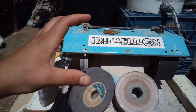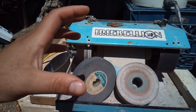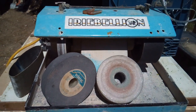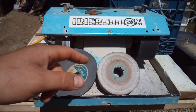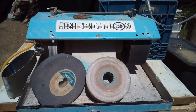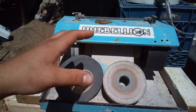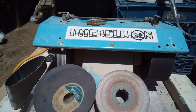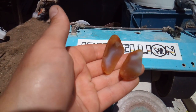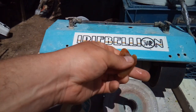When it comes to larger agates, I don't know anybody that polishes large agates on diamond wheels. Companies like Highland Park and Richardson Ranch make machines like the Bull Wheel and the Richardson Ranch high-speed grinder that use silicon carbide to polish agates. They only take it to about 600 or 1000 and then use cerium oxide, which leaves a finish closer to 50,000 grit — maybe even 100,000 grit depending on the material.